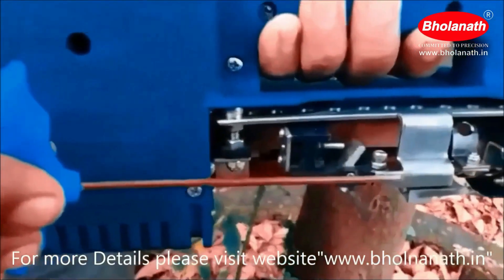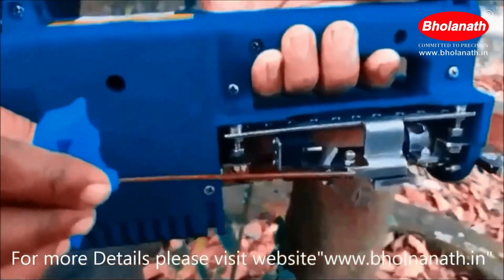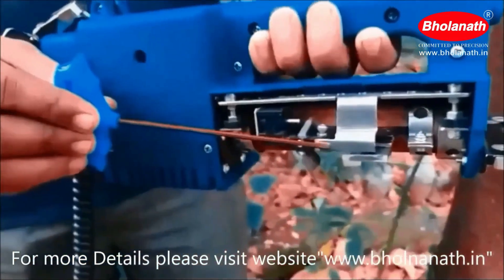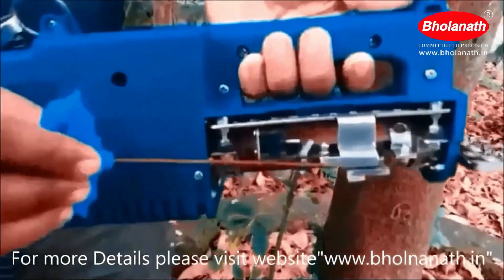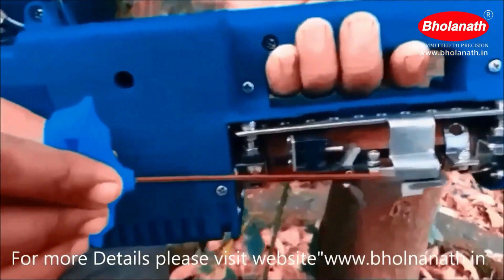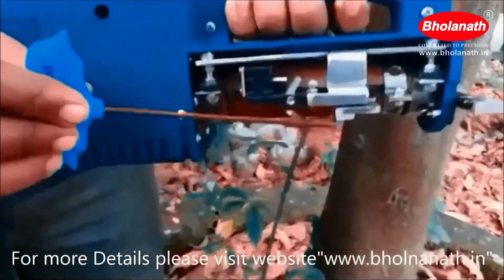This is the machine sensor. With the help of this sensor, damage to the tree is avoided. Even with minimum tapping of 1.5 mm, the cambium of the rubber tree does not get damaged. By this, the life of the rubber tree, which is now being used for 15 to 18 years, is increased to 30 to 35 years.